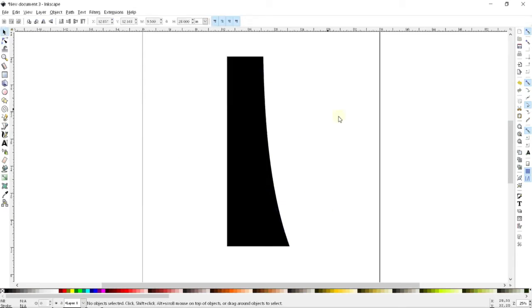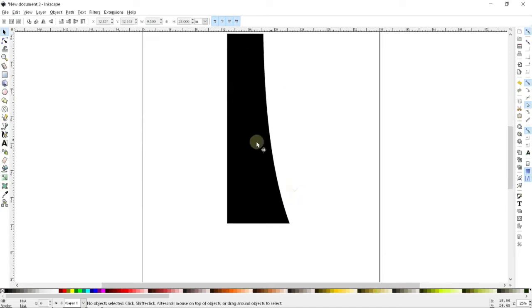So there we are. Now, the one last thing that I'd like to do here is change around how the bottom works. If I left this like this, this stool would have a huge amount of surface area against the ground. The whole width would all be touching the ground. In a perfectly flat room, that's not a big deal. But oftentimes, chairs with large flat surfaces on the bottom tend to increase the likelihood that you get some pebble or some unevenness in the floor under one of those parts, and then the whole thing's going to teeter-totter.